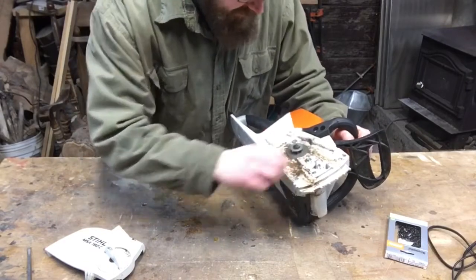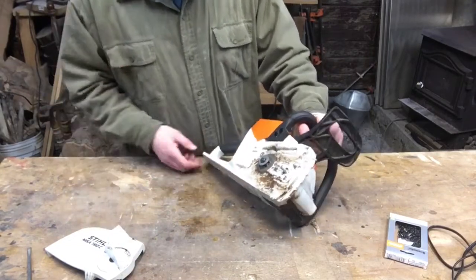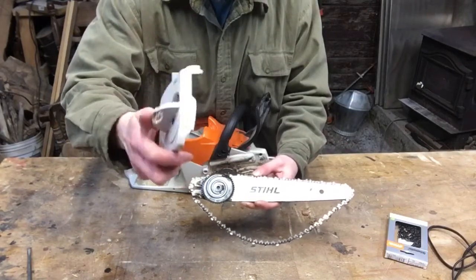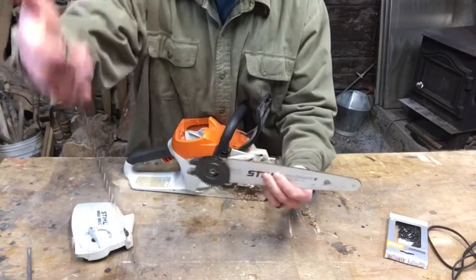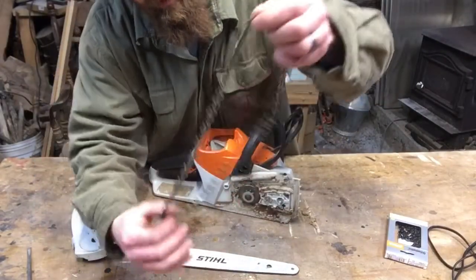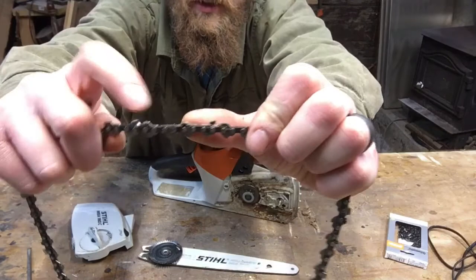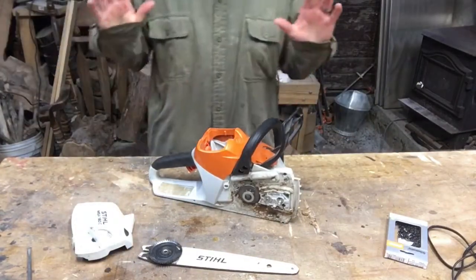Looking in here, there's really not much else I need to do. I could blow this out a little more and clean it — that's totally up to you. What we're getting down to is these pieces right here. You've got your bar and you've got this piece with teeth on it. This actually connects to the piece on the inside, and this is where you'll tighten everything back together when we're done. Just remove the chain — it's pretty easy, just pop it off. Done. There's your bar. Everything's apart. Here's a missing tooth, and there's another missing tooth. I broke that tooth right off. Nails will kill your chain — this thing is so dull that when I cut even pine now, it just smokes like there's a fire.